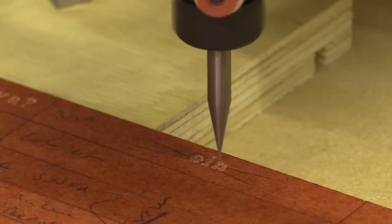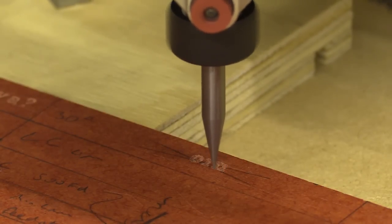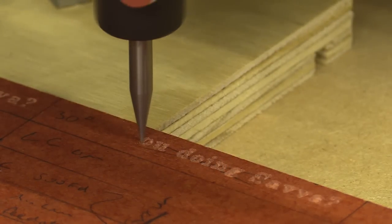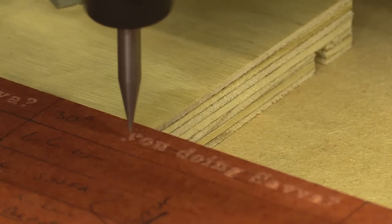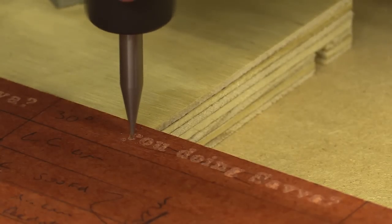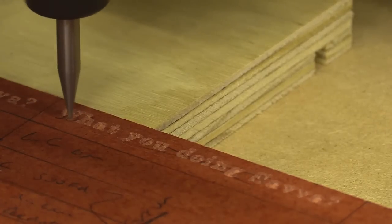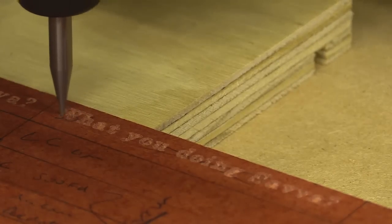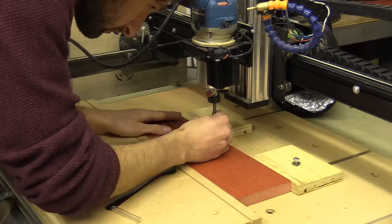Using the carving liner to engrave some small lettering, it works well on text up to 4mm tall when limiting the tool depth to 1mm. Because of the 22 degree angle, above a certain size of lettering the bit plunges a little too deep and the lettering looks a bit odd. I also had some problems with parts of lettering chipping, but this is due to a combination of my feed rate and the material I am cutting.